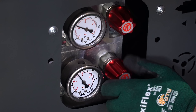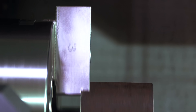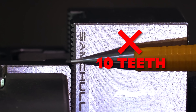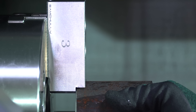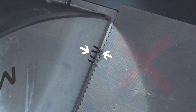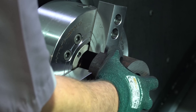I'll lower my chuck pressure way down because I haven't torqued my bolts yet. Load some material and spin the chuck by hand, making sure that the material looks like it's running true and that I haven't skipped a tooth. If we had miscounted teeth when mounting the jaws, you'd see the wobble in your part. We will also check the stroke limit lines on our chuck to make sure that we are near the middle of our stroke when clamped — this is important, because if we are near the end of our stroke we might not be fully clamped on the part, but just bottomed out against the end of the jaw travel. We also want to make sure that our T-nuts don't extend beyond the body of the chuck — this isn't safe.